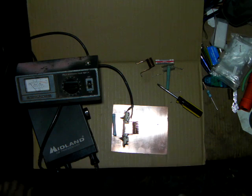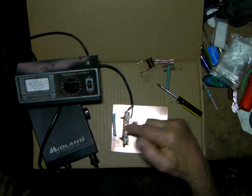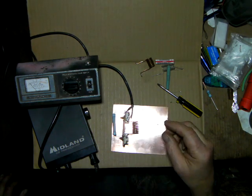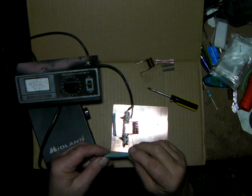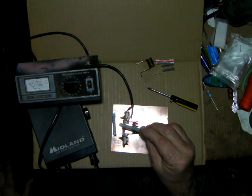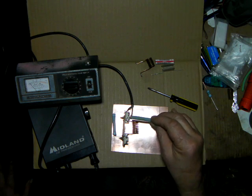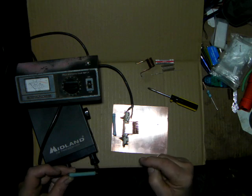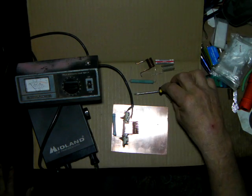But it won't be much. This will get you so close that you can take it off this little test setup, drill your holes in your tube air box, mount this all up. You can shorten the wires, keep it all clean, have it tucked away close to the chassis — you're not going to want that long of wires on it. These resistors are probably getting hard to find. They're seven watt — some listed as five or four watt. You want this resistor to be at least whatever your radio is putting out, and maybe a little more. You can make this up out of several resistors: put two in parallel, then two more in parallel, put those two sets in series, and you come back out with the same resistance but four times the wattage of dissipation. That's how easy that is.